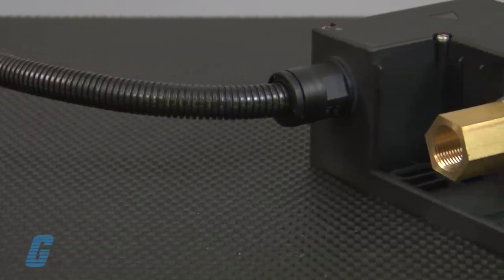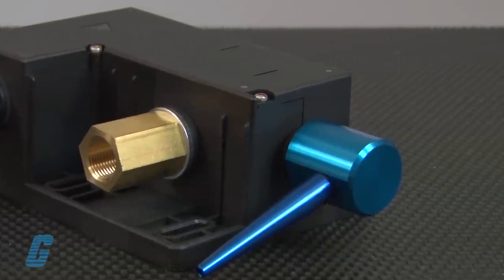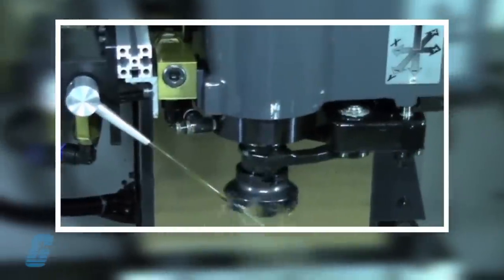The Wavy Nozzle features angle and speed configuration for maximum precision. In addition, three unique movement modes are available: fixed mode for a fixed angle, sweep mode to reciprocate between two specified points at a constant speed, and kick mode which operates in a reciprocating motion of the nozzle with a variable speed. 99 motion pattern settings can be stored on the unit, and up to 31 pattern settings can be called up using M codes.